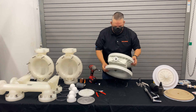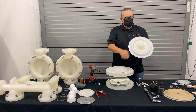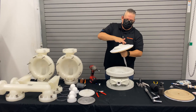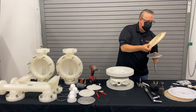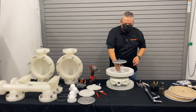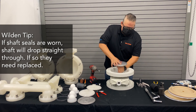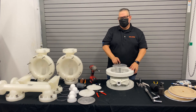Now that the air valve is fully on, it's time to put the diaphragm assembly back. This is the full-stroke Teflon — it uses the same hardware as our rubber and TPE fitted pump. By taking off the outer piston, the primary diaphragm, and the back of the diaphragm, you simply change it over to the new one. Another way to check your seals: if your shaft seals are worn, your shaft will just drop straight through. Those seals should hold the shaft up with enough tension — if the shaft falls right through, it's time to replace those seals.